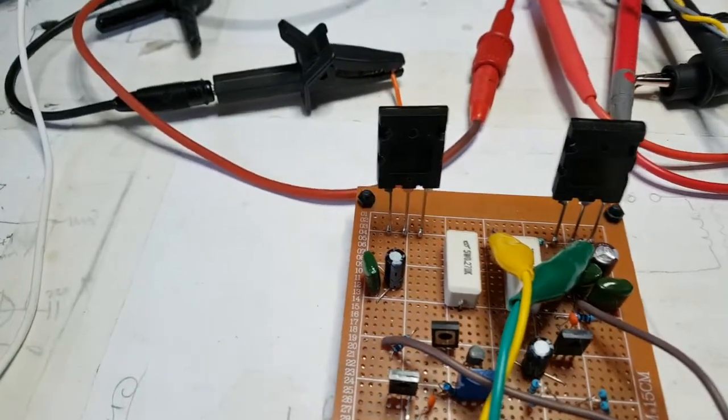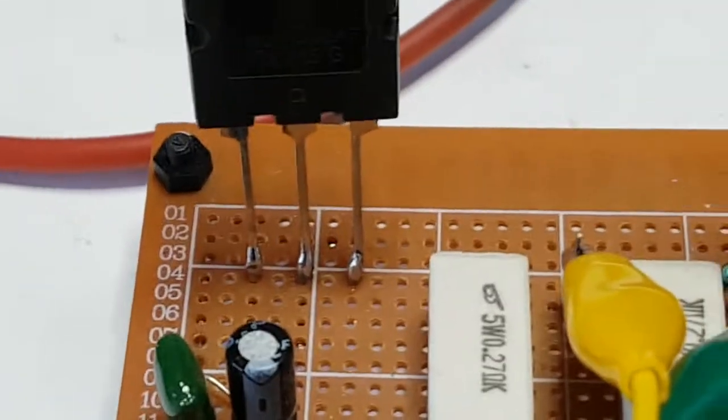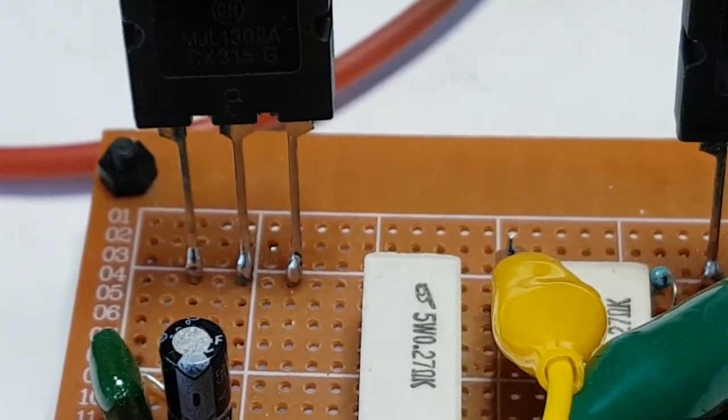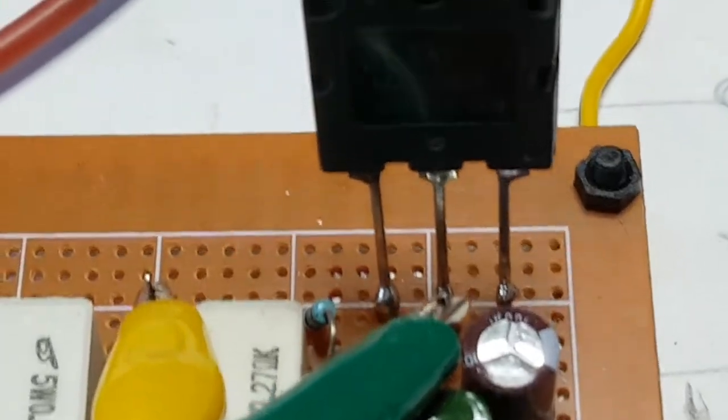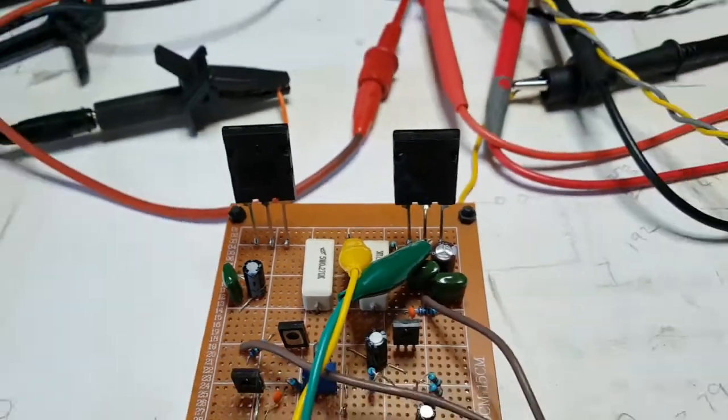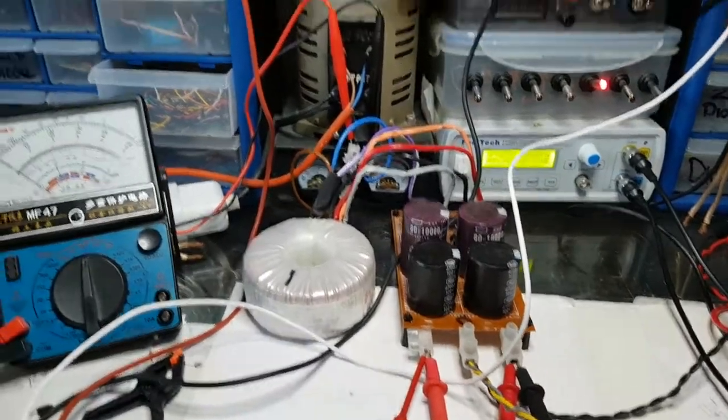So, okay, look, it's not really pretty, again, I soldered them from the backs to the front, so that little blob there is just the way it is. As long as we've got a connection, this isn't the final solder of these. I just want to see if we've still got a short. We're on 0 volts over there. I'll put this down, and it's the current that we're going to be looking at.